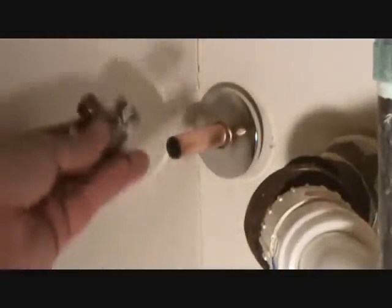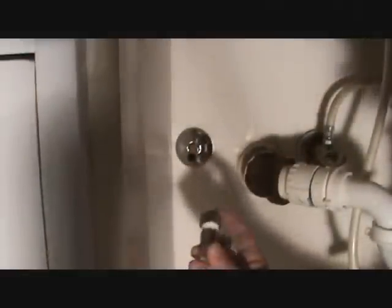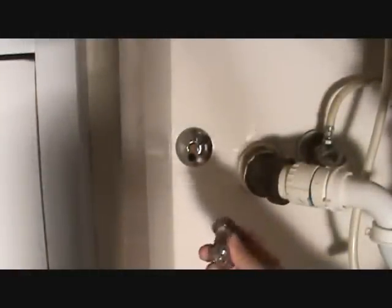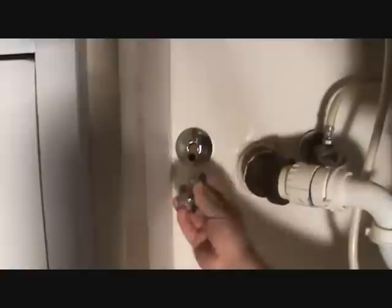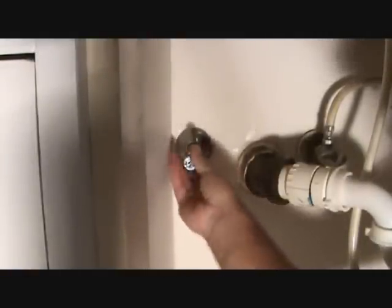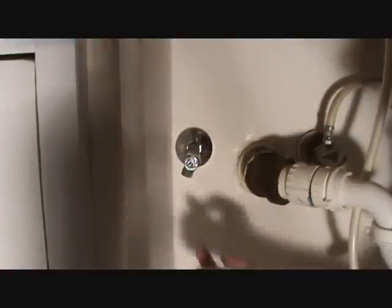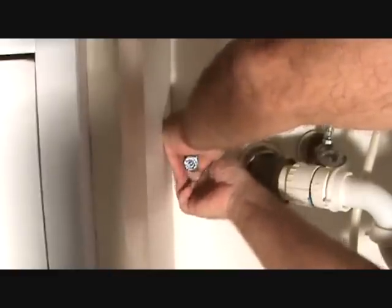So I'm going to put some Teflon tape on there. Do you remember how to do that? I put the nut back on loosely with the ferrule inside and the Teflon tape on the outside. You can just wedge it on there. You don't want to get carried away and just have it on there and start tightening with the outlet down low instead of up. I've got it pushed on all the way and I'm going to tighten it up by hand a little bit first.